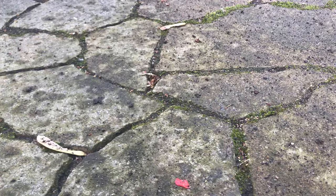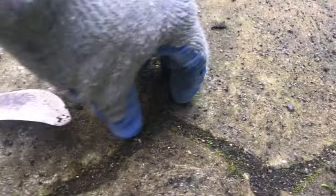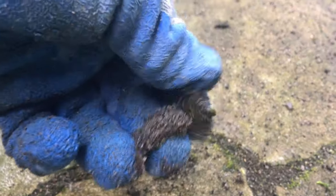With resin-based jointing compound, you can pressure wash it and it stays in place. With jointing chips, when a joint stabilizing sealer is not applied, it becomes more difficult to maintain as dirt, pollen, and other particles work their way in over the years. Maintenance typically means scraping out the joints and possibly reinstalling chips after a few years — though the timeline depends on the environment, such as whether there are trees overhead. This needs to be discussed with your client if they want a fully permeable system.